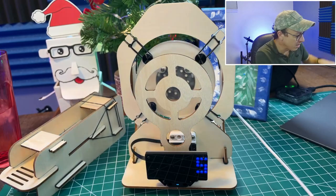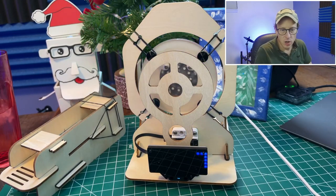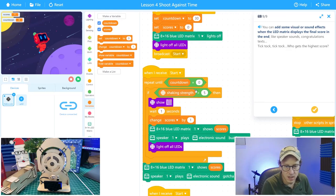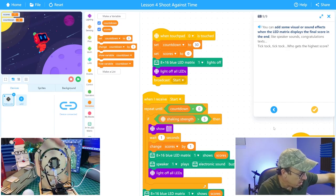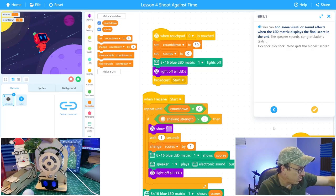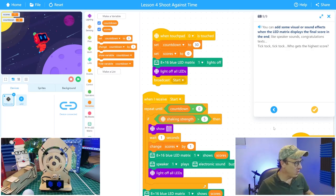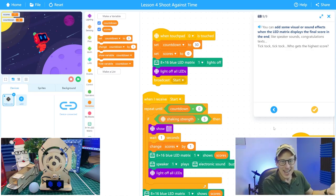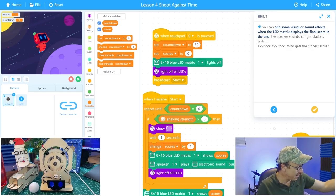You can see — hitting up there doesn't trigger, but hitting the microcontroller does. You can tweak the sensitivity by changing the five to a six or higher. Touchpad three resets the game and shows the eyeballs. You can adjust sensitivity — it's mind-boggling what you can do with microcontrollers that cost next to nothing. You can build an arcade game from ten dollars worth of components and a couple chunks of wood.